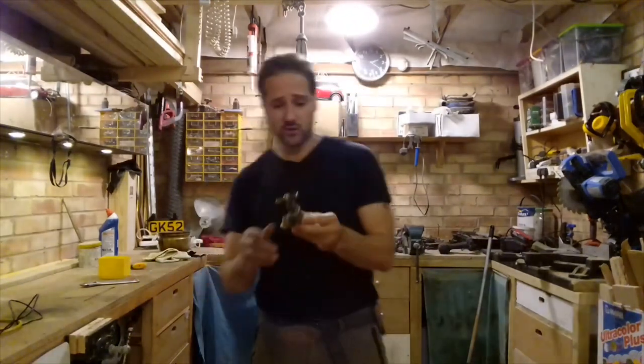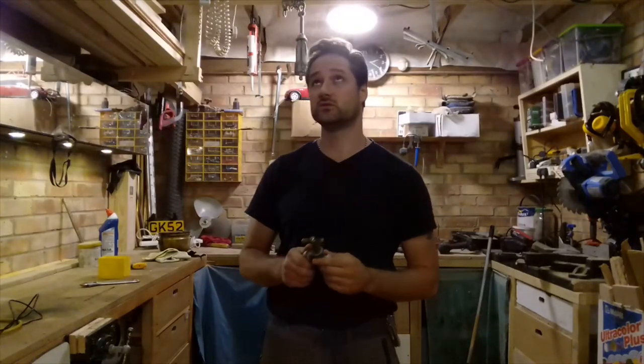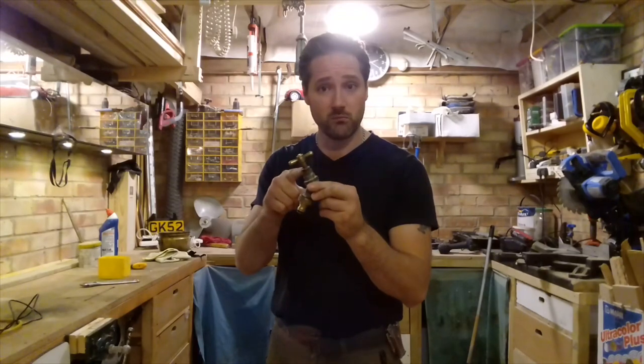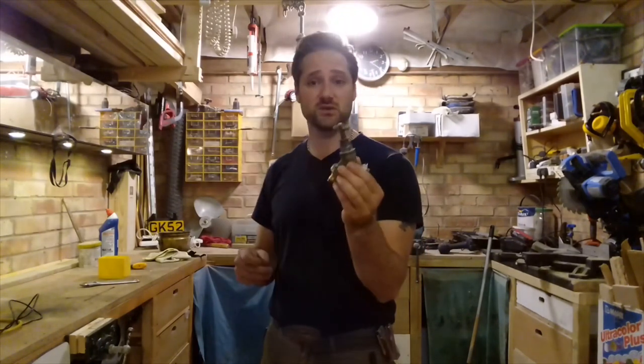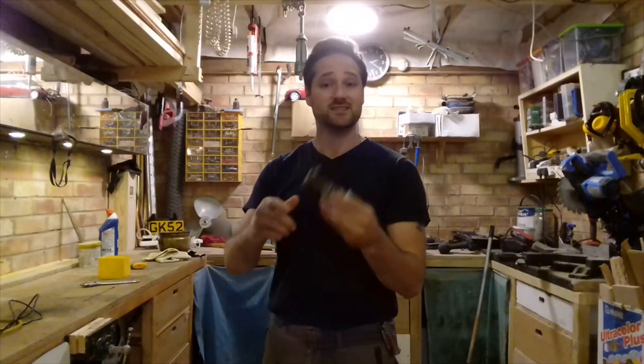Outside stopcock, also known as a BS 1010 or EU 1234, I believe, actually. Inside this little shaft is a rubber seal. After a while, when this keeps turning backwards and forwards, that rubber seal fails ever so slightly. It doesn't properly fail, because if it properly fails it just explodes away, but just a tiny little drip. So that's why your cock drips, you see?